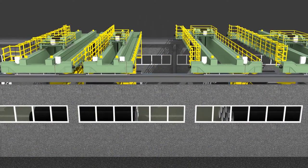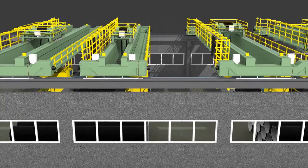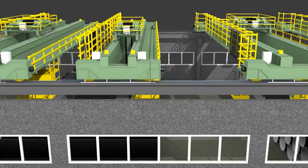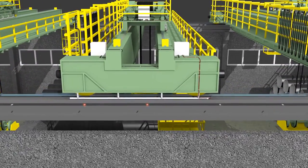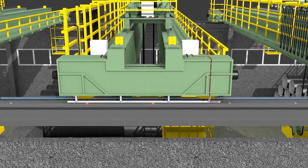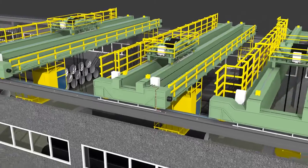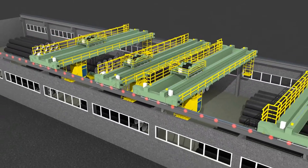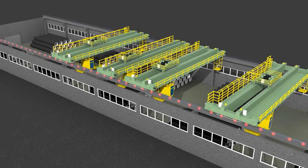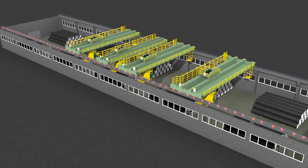The Magnetrack system allows positioning of several objects on one and the same layout of magnets. Let's set permanent magnets along the X coordinate so that there are two magnets in the active zone of a transducer. In this case the length of the span can be up to 400 meters. If the span is larger, it's possible to set three magnets in the active zone of a transducer, enabling positioning along the X coordinate at distances of several kilometers.